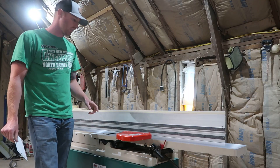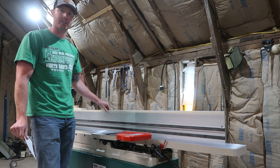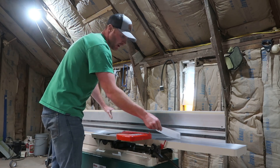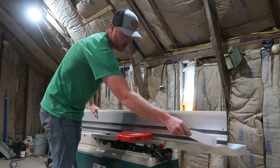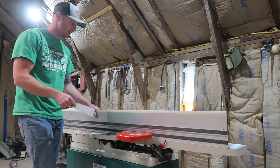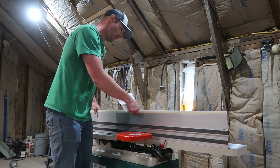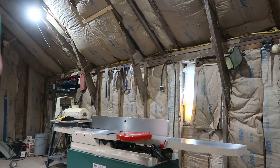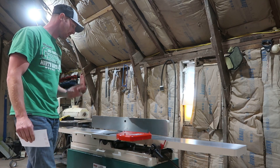To get the finishing touches on getting these two tables parallel, I grabbed my track saw rail — it's a little bit longer and probably more accurate than those Stanley levels. With this in place I'm able to run the sheet of paper around both sides, the front and the back, without it going through. I'm pretty happy with that. Keep in mind I'm using a sheet of paper and not a feeler gauge, but a sheet of paper can't be more than about three or four thousandths of an inch. Now I'm just going to get the fence set to 90 degrees.